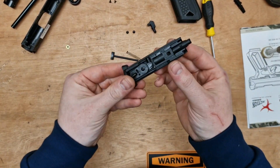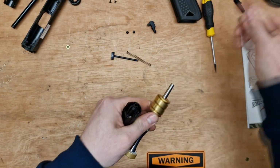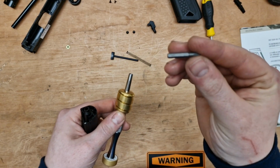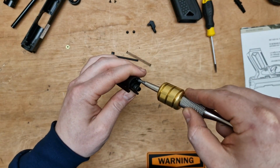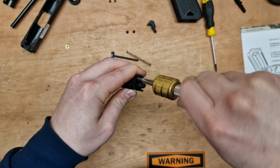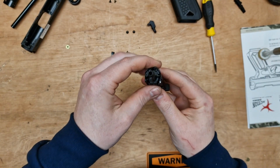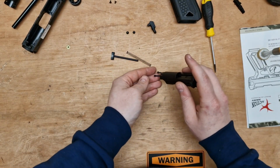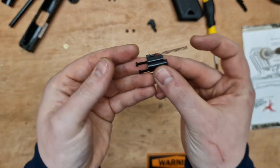The assembly here, you've got two Phillips screws just in the end here, so we're going to switch back to a Phillips, and the Phillips that I've been using is a PH1, just a small style screwdriver in this fancy doodad I've got here. I'm going to release those two screws, and that will enable us to pull everything out the front here. Just give it a wiggle, the two screws and the mounting plate which holds the nozzle spring will come out like so.